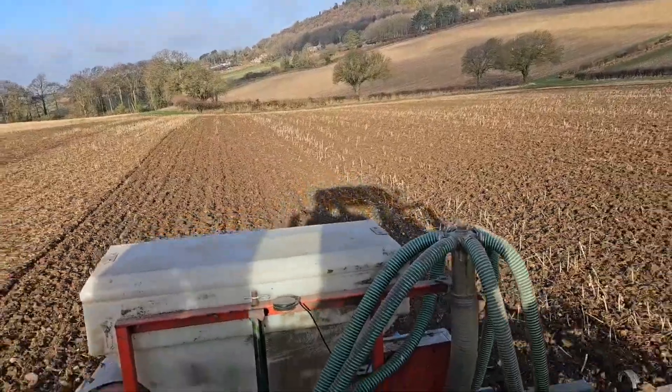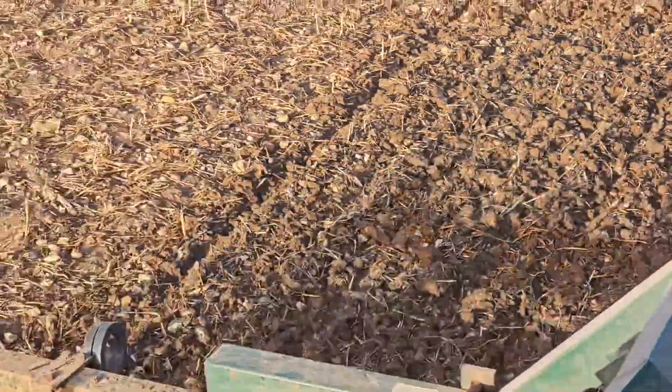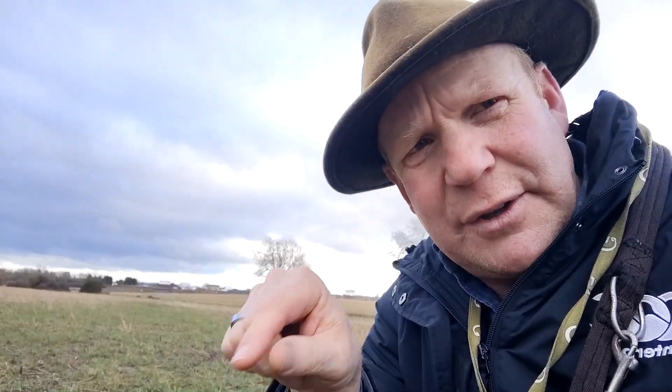So I might as well just go ahead and do a carrier pass where I know I can move all of the soil — the whole soil plane will move, I won't get any ridging of unmoved ground. That will also help me pull up these black grass plants. On the light land we did a pass with a tine pigtail cultivator a couple of weeks ago, and actually when you turn the plants upside down you can see the roots regrowing from the black grass. So even though it's pulled them up, they are trying to regrow. On the weight of it I'd prefer to go with a carrier over a pigtail, just to get that full ground movement.